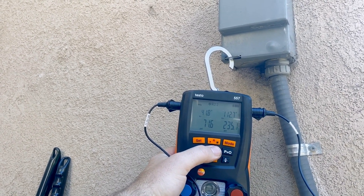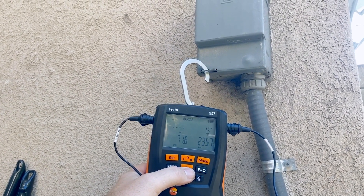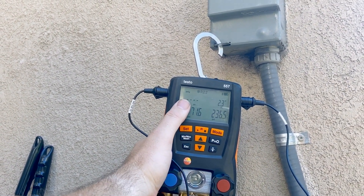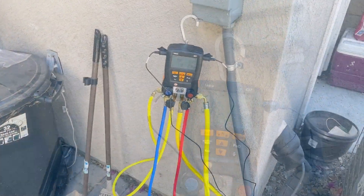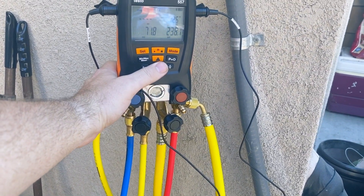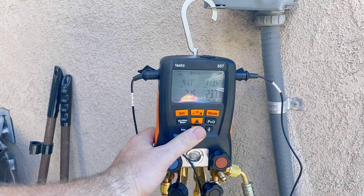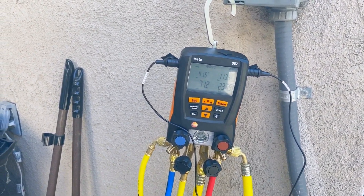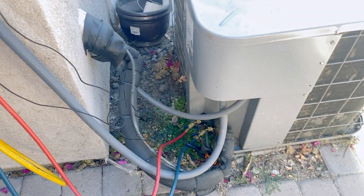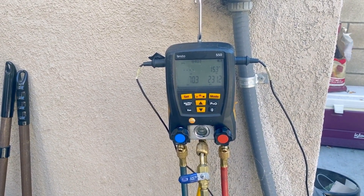The system isn't working quite right — we're getting zero superheat. The clamps take a little time to adjust so we let it run and wait for it to stabilize. We are getting some subcooling coming on. Zero superheat — something's going on with the system but I'm not dealing with that today. Then there's your Delta T. Pretty simple to use, nice and rugged, and waterproof for the most part — I've left them outside for days at a client's house. The old Testo 550 hooked up in the same spots gives the same readings.